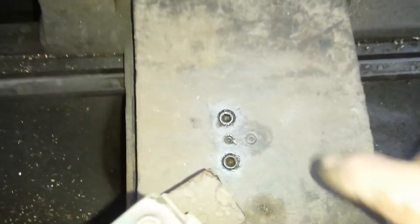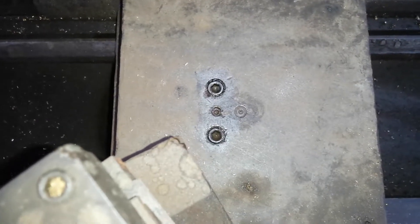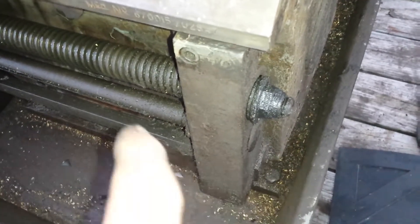I don't know how long they ran it like this. These two screws — these Allen caps that hold the lead nut — those were loose as a goose. And back here, those Allens and that yoke that the lead screw goes in were loose too. Yeah, it had slop, slop, and more slop. This nut was sloppy on the lead screw for the carriage, so I imagine threading was a little bit nebulous.